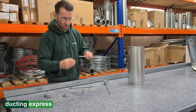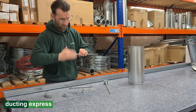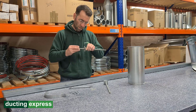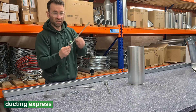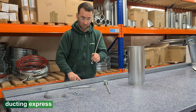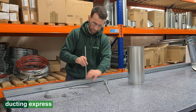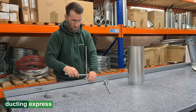So I'm going to take the M10 rod, stick a nut on there, and I'm going to take the top plate and put it down like so, and your channel nut. Once we've got that on there, just make sure when you're putting your channel nut on, the grooves here are facing up so they can tuck inside your strut. So I'm going to drop that in there, once that's in, nut down, tighten.